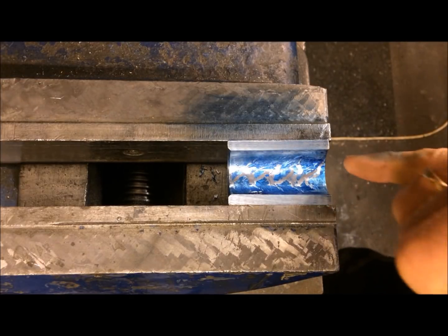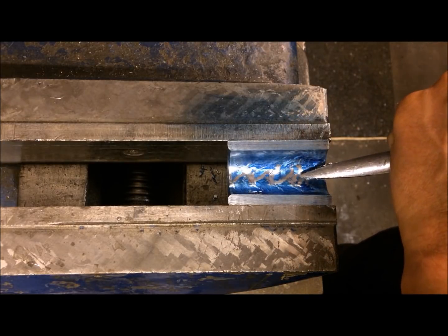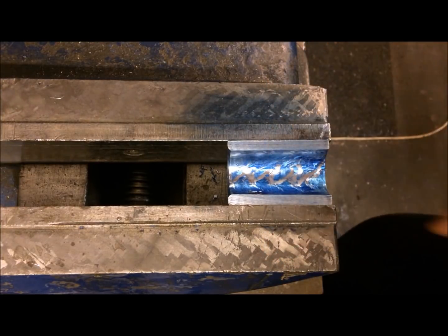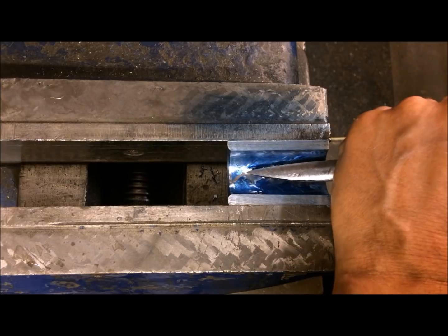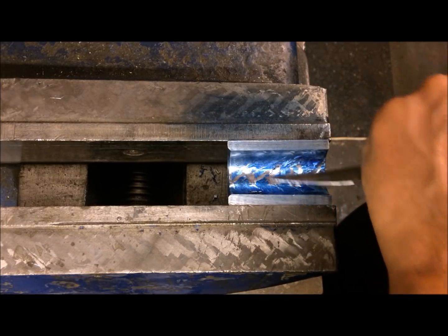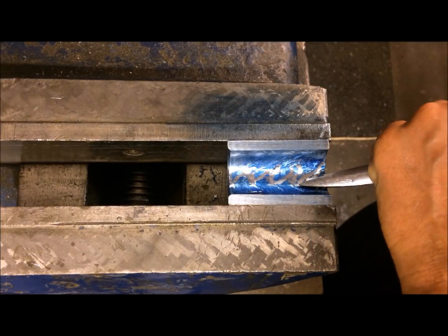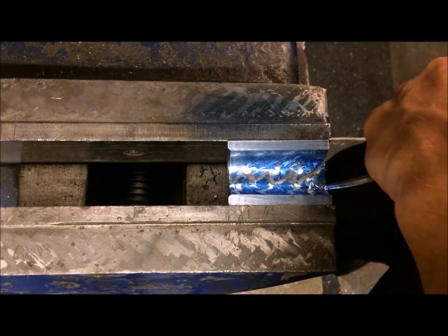Not so clear, but that should produce a crosshatch pattern. The inconvenience of an internal cylinder like this is that it's much more convenient to work down there rather than up here — it's much harder to hold the angle. So I try as much as possible to rotate the workpiece. I always work on the lower part because going up here is much harder.